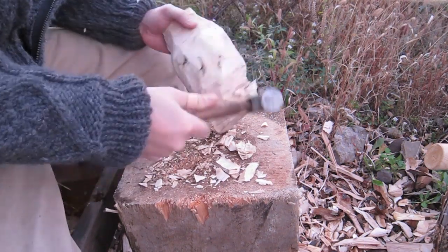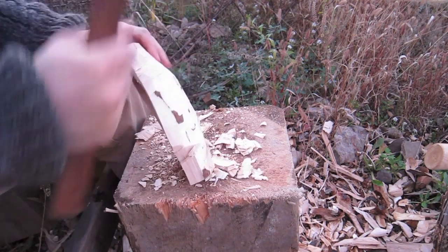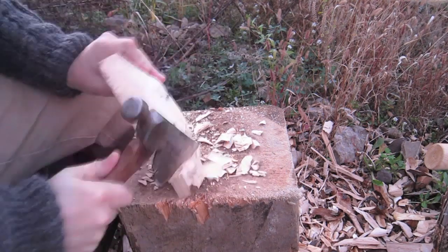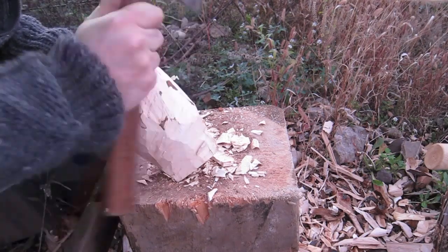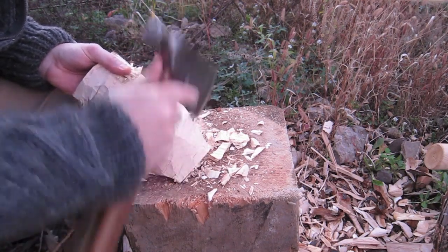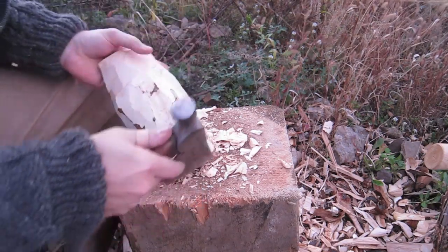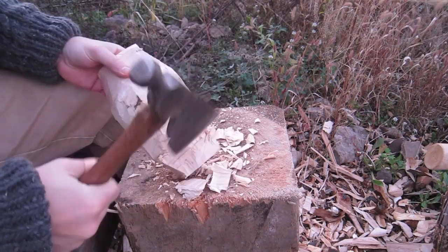There's another example of me switching to the other bowl. I have quite a few hatchets — most of these other two hatchets that aren't the eBay one I got with the adze are old Plumb hatchets I've had time to work on their bevel. This lighter one has a very flat fine edge on it. But the one I got from Mapsist, the eBay one, was easy — you can see it worked very well. I ground a little bit of the edge for the second bowl. When I choke up, it's more detail-oriented and I arc the swing more — you're going to let the handle fly, and then choke back to get more power out of it.